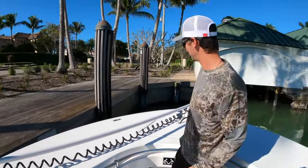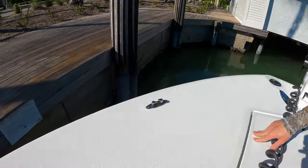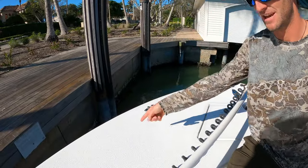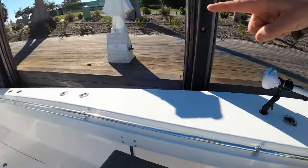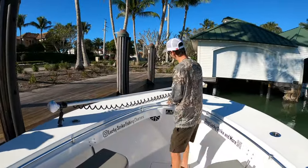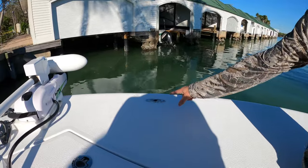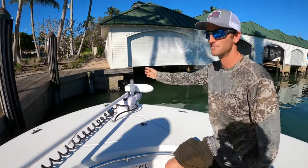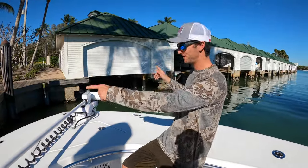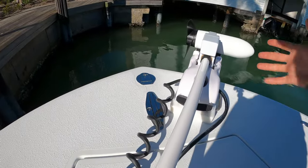Something special I did: typically Onslow Bay puts two cleats up here, but I put pop-up chocks. This allows me to, when I let the anchor line out, put it through this chock and run the rope down the boat and cleat it off at the back cleat. So I can manipulate the boat forward and backward without having to come all the way to the front. I also have one on each side — cleating on the left moves the boat left, cleating on the right moves it right. So if you miss your spot by 15-20 feet you can adjust. And I've got a cleat dead center up front for docking.